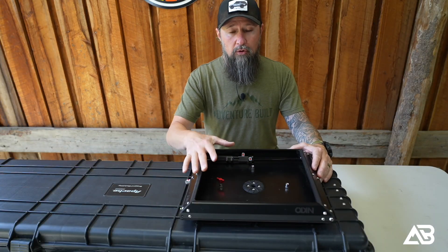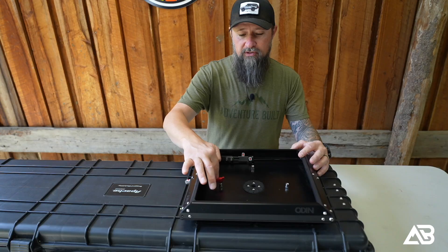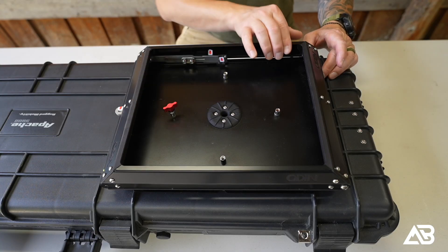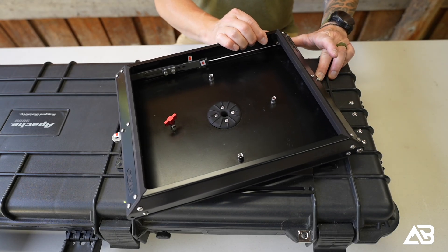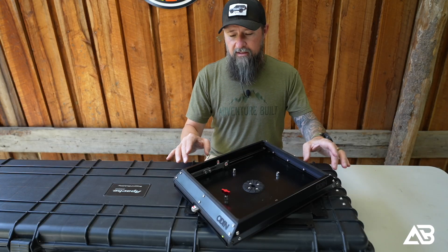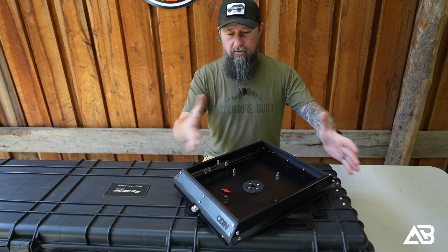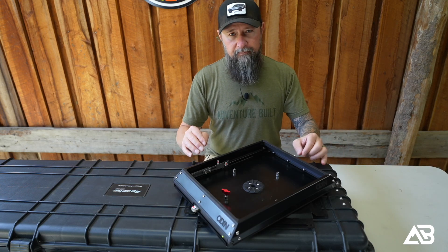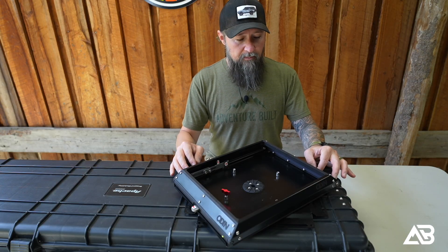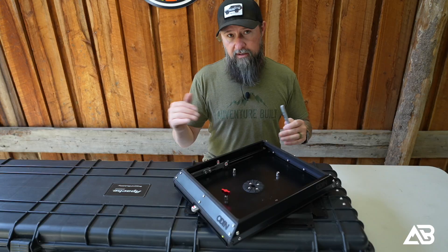The first thing I'm going to do is get the Odin Hardware Starlink Mini mount mounted onto the top of the Apache case. I'm going to loosen this red screw — that allows it to rotate — and without losing the position, I'm going to spin this around so I can access the holes I want to drill. I centered it in about the top quarter of the ribs on the case. Because it's ribbed, it'll be a little harder to seal, but I'm going to drill all the holes and then go through and put a bunch of silicone in them so water can't get in.